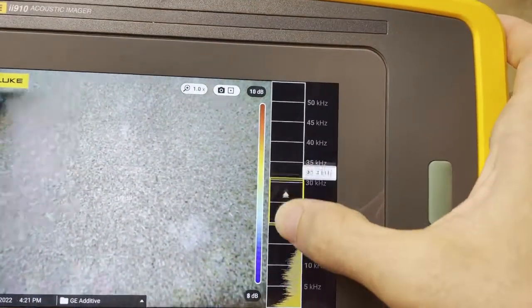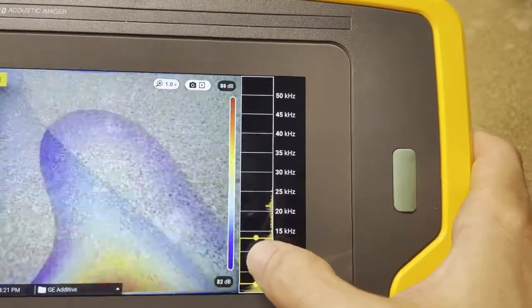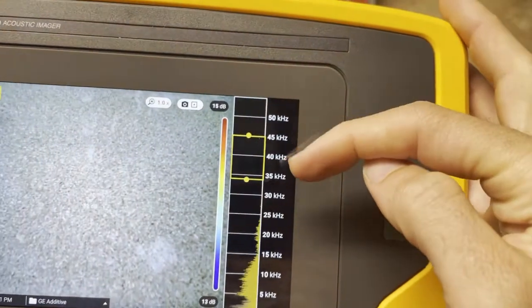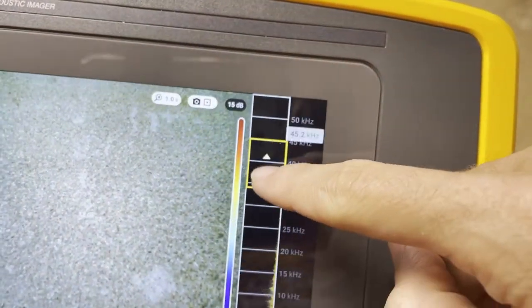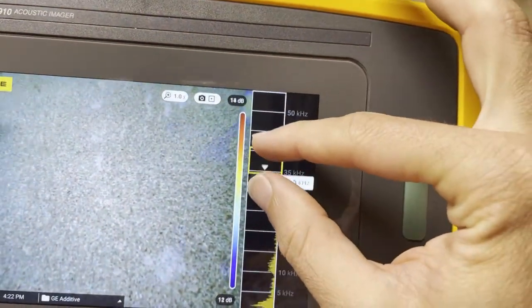You can adjust the frequency by scrolling up and down. Down here you can see my voice — these little audio amplitude bars coming across — and you see a lot of noise. If I scroll up, those all go away because we are at a much higher frequency that we're listening for. So you're going to want to listen between 35 and 45. If you have occupancy sensors in your facility, sometimes those ultrasonic occupancy sensors will be around 38 kilohertz. If that's the case, you will see a very large spike, a lot of amplitude right at that frequency. All you have to do is get right above it or right under it and that will make everything go away and make it much more clean. That's how you can still use it in those environments.